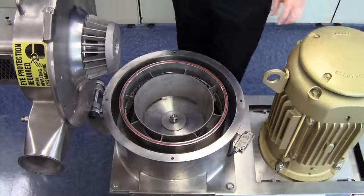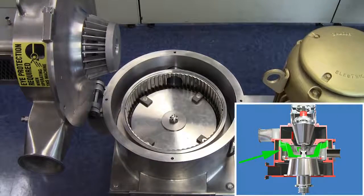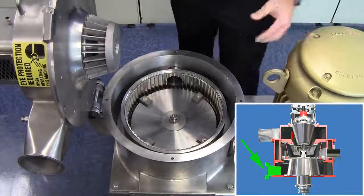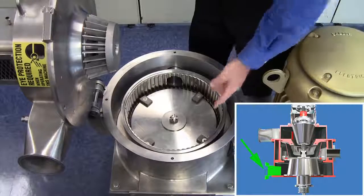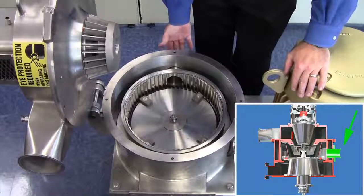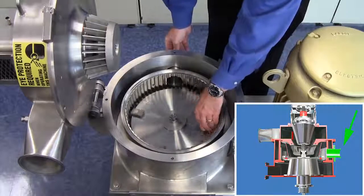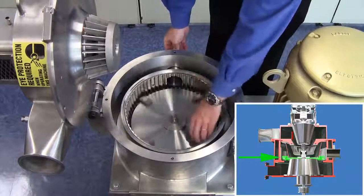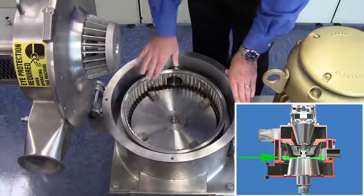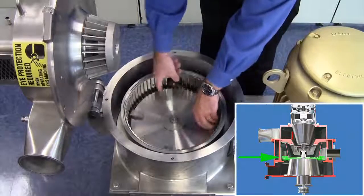The air classifying mill works as follows. For demonstration purposes, I'll remove the baffle shroud assembly. Downstream of the air classifier mill, we have a blower which pulls a vacuum on the system. We have two air inlet points on the mill: the primary air inlet, which pulls airflow up from the bottom of the rotor disc, as well as a small amount of bleed air which carries the feed particles in. Here we're showing the feed tube or the feed entry into the grinding zone, where the feed particles enter the path of the hammers. We're showing a bar rotor assembly capable of speeds up to about 22,000 to 23,000 feet per minute, as well as the multiple deflector liner, which redirects the particles back to the path of the hammers for more efficient grinding.